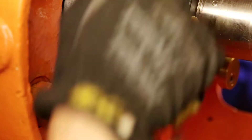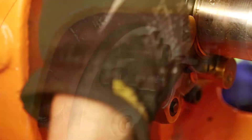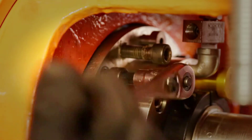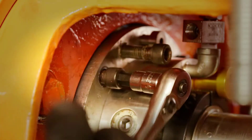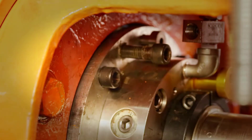A gap will begin to occur on the rear bearing between the snap ring and the outboard bearing sleeve. If you encounter any issues — for example, if the bolts jam up or something isn't moving — reevaluate. Ensure the set screws are loose, the snap ring is removed from the rear of the mixer, and there are no issues with the mechanical seal.